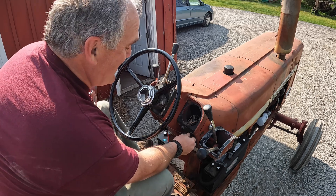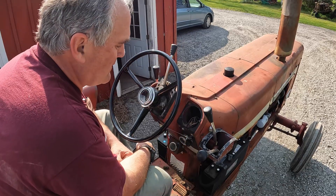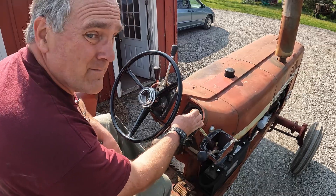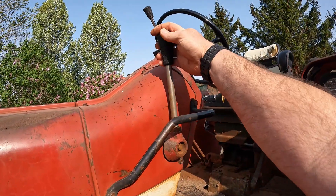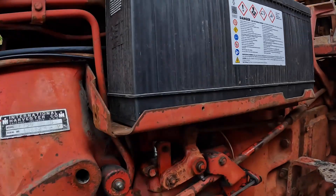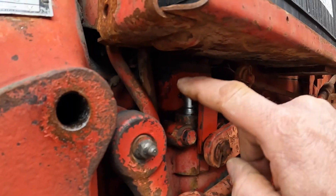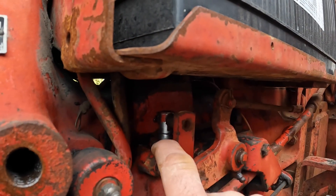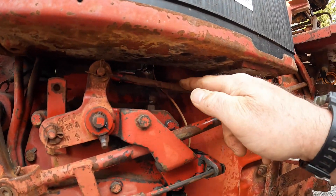Let's start up the tractor and I'll show you what the problem looks like. If I let out the clutch, let it run, push in the clutch — hear that? Out of adjustment. The first step is to make sure your torque amplifier shifter is in the forward or direct drive position. Then with it in the forward position, look down here where all the torque amplifier linkage is. You see this plunger here on the spool valve — that snap ring has to bottom out on the spool valve, and right now we know the torque amplifier is out of adjustment.